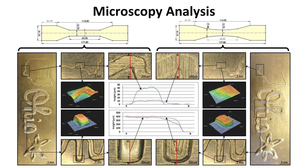Using the knowledge of these varying pressure distributions, the embossing operation was conducted with both foil geometries. The resulting embossing quality was examined using an optical microscope, and the dimensions of the corresponding feature heights were measured using multi-image depth composition techniques. The results for the single path foil are shown on the left, where features near the foil end and foil center are magnified. The same regions were also examined for the single point foil results, shown on the right. The three-dimensional reconstructed images allowed for the measurement of the embossed features, as plotted on the graphs in the center. The top graph shows that the single path foil created more fully defined features than the single point foil for the outer regions, such as the state outline and buckeye leaf, while the bottom graph shows that the single point foil created more fully defined features for the centrally located regions, such as the script Ohio letters. This demonstrates the capability for vaporizing foil actuator embossing to tailor the pressure distribution according to the desired outcome of the operation.